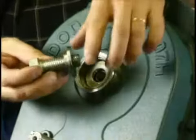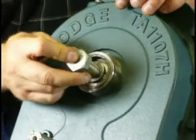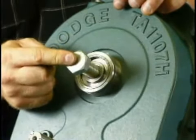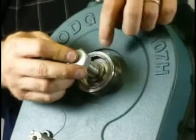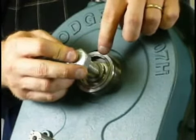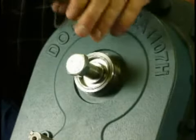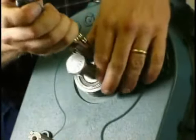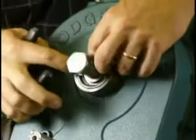The next step is to position the keeper plate on the removal bolt as close to the snap ring groove as possible without covering it up. This makes sure that you have a minimum number of turns before it backs against the snap ring. Then put the snap ring back in place over the top of the screw in the snap ring groove.